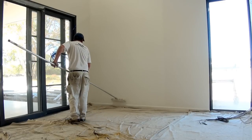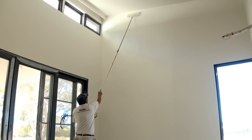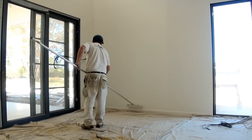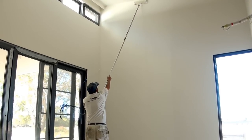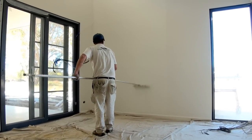Now I'll lay it off. Once again I'll start just past where I joined, go to lay the top, let the roller slide through my hands again, and get as close to the ceiling as possible, letting the roller pole slide through.